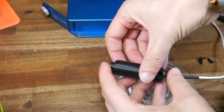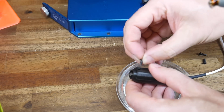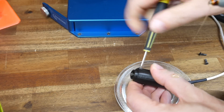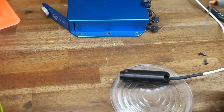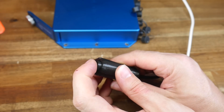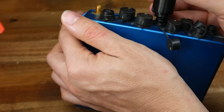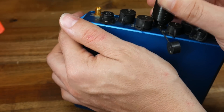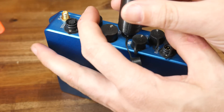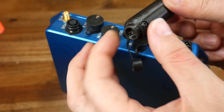Once everything was coated in hot glue, it was time to put on the second housing half and screw the two together. I made one silly mistake — working directly below the hot glue gun, which dripped onto my thumb. As I needed everything to stay aligned, I just had to put up with the burning and screw the two halves together. As I peeled off the glue it took the skin with it, but the job was done. After letting everything cool and solidify, I tested the pins by pushing on them hard and none of them budged. The real test was plugging in the cable to the port, and I've been able to do this reliably — plugging it all the way in gives a good enough connection to support the weight of the whole V-Box unit. When the cable is removed, all of the pins are still in their proper locations. I'm calling this approach a success.